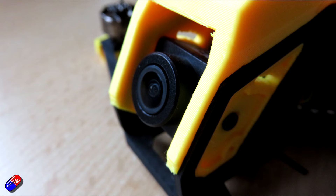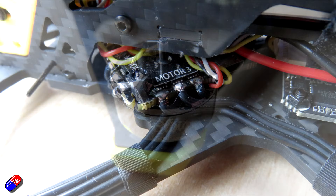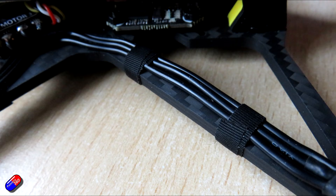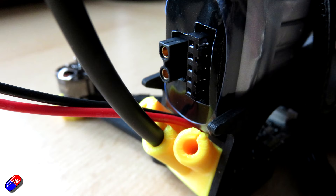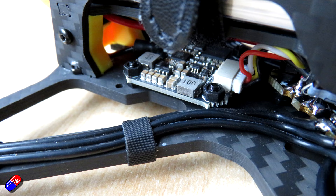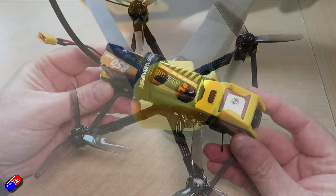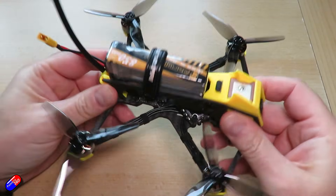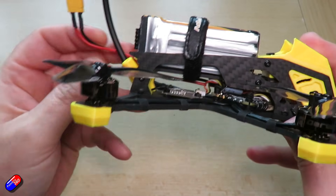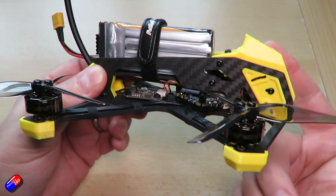There is an awful lot to like about this little quad from Darwin FPV. If someone had handed me this, I could have easily mistaken it for a Speedybee quad — and that's a very good thing. This is a much more grown up, finished, professional-looking quad than their earlier smaller units. 4S power in this pocket-sized quad means it's an absolute blast to fly without sacrificing performance. I do like the fact it's an F7-based all-in-one unit — that's an excellent choice, giving us 8K PID and gyro frequencies without the CPU breaking a sweat. I also like the frame design: elegant and strong with tons of space for HD FPV systems.